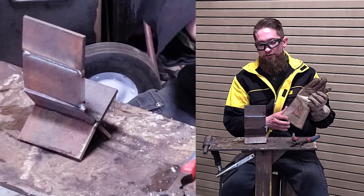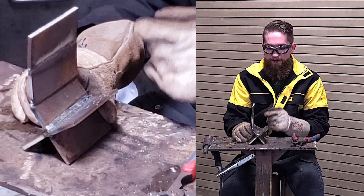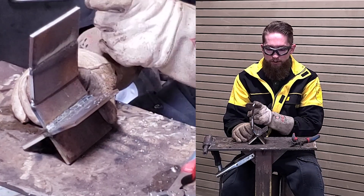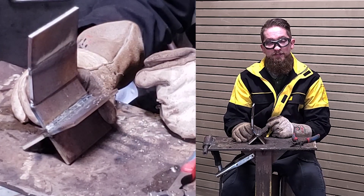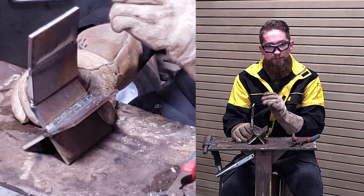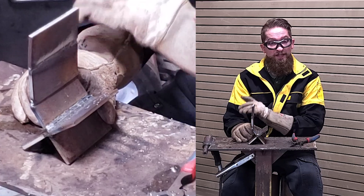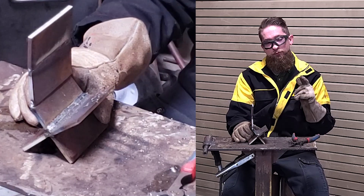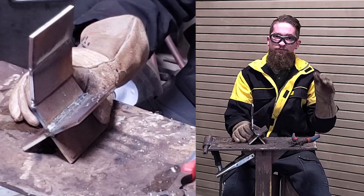So there's our horizontal butt joint. Settings for this are pretty important — I would look at the chart, look at the material I'm welding on, and go slightly less than the material thickness recommendation. This is quarter-inch material and I have it set slightly less. If I was welding on 3/16 material I would set it slightly less than 3/16. It also depends on the gap: if I put a large gap in I need to put my settings down further; if I have a really tight gap I want to turn my settings up. Focus primarily on your wire feed speed — wire feed speed is your penetration, it's what's driving that puddle deeper into your weld.